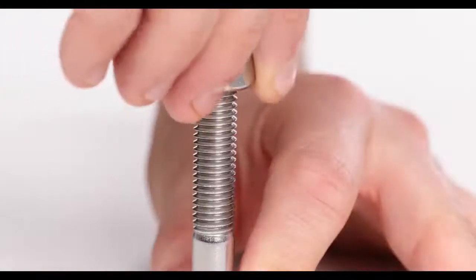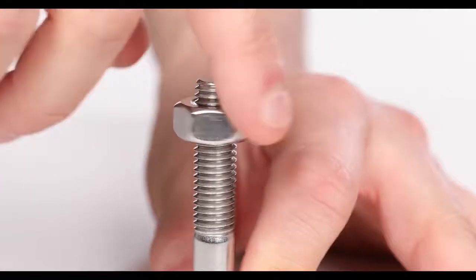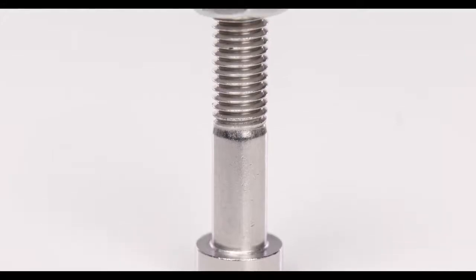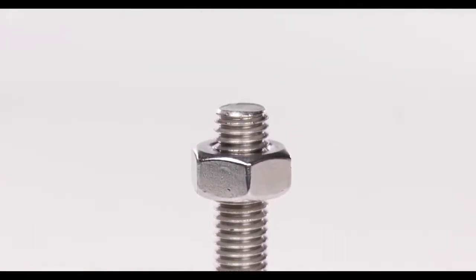Nominal diameters then are simply the way we name thread sizes to make it easier to define them. This is probably best explained by looking at tolerances. Basically, tolerances allow for undersizing and oversizing to ensure that fasteners will actually fit together. You see, if a metric machine screw and nut both had a major thread diameter of 9.9 millimeters, it would be impossible for them to fit together. There would just be no clearance room for the nut to thread onto the screw. But, thanks to tolerances allowing for under and oversizing, a screw and a nut that both have the same nominal thread size would pair together, providing of course that they have the same thread pitch.